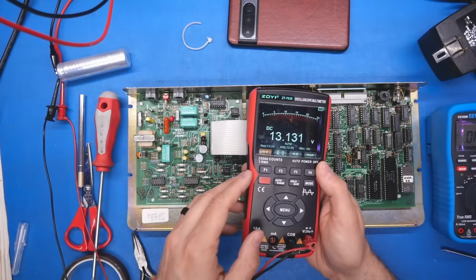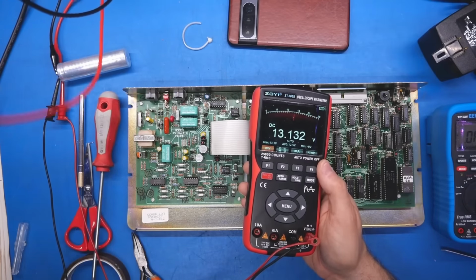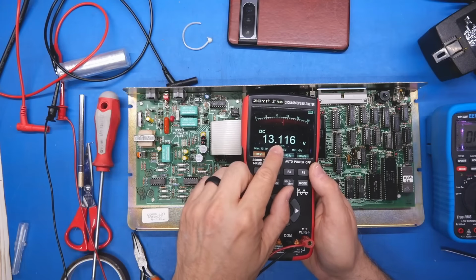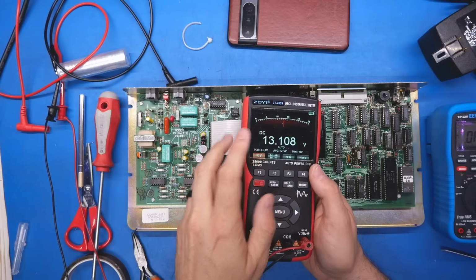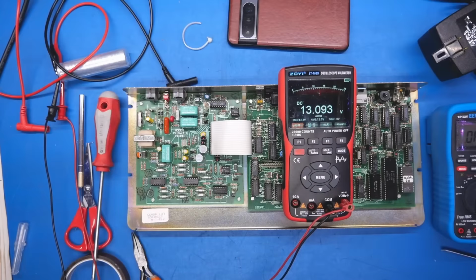All right, well, that capacitor's been sitting here at 13 volts the whole time. So I'm going to unplug one of the legs from the power supply. Wow. And it's sitting there holding that voltage without any issues. So this Sprague cap is in good shape. I do need to discharge it before I hook it back up to the system.